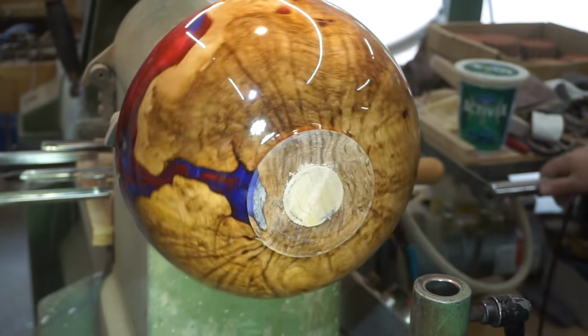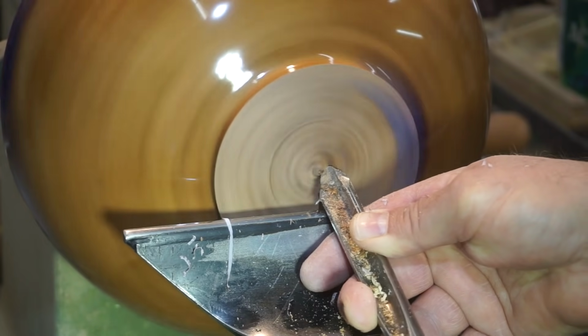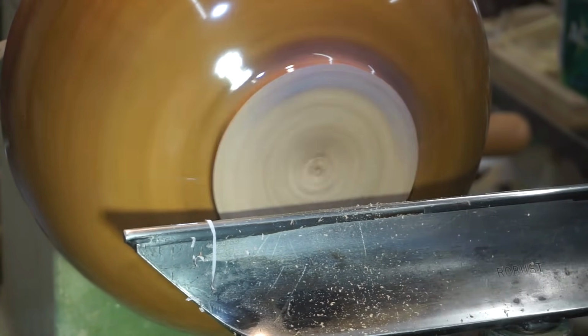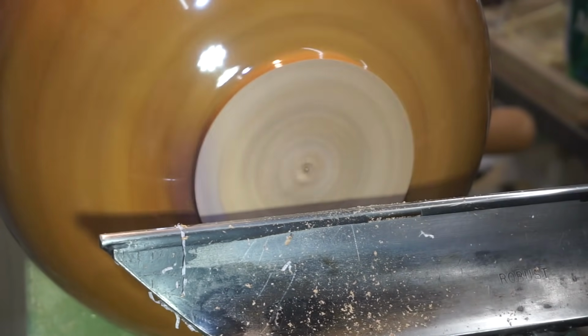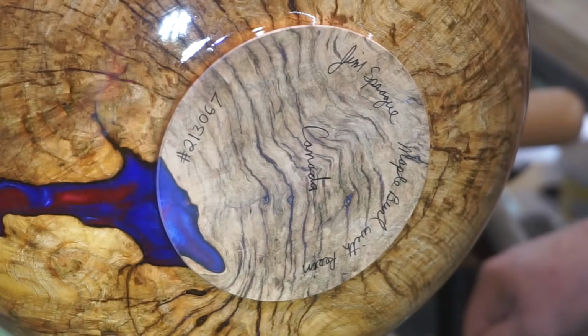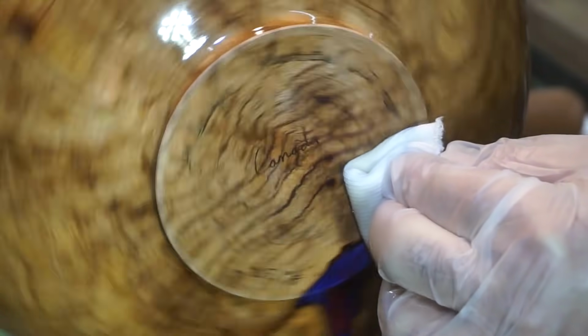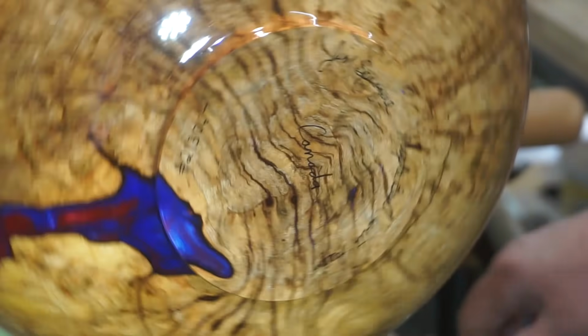The other thing too is, you can put a mineral oil and beeswax finish on these bowls. And yeah, maybe they'll look fine, but there's no way it's ever going to bring out the beauty like these shiny finishes, like wood bowl finish or salad bowl finish by General Finishes can. So I realize why a lot of people don't do them, but you need to do the wood justice, and these finishes will do that.